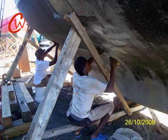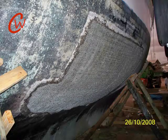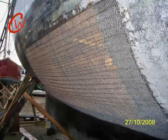The ties are done with a device that we manufacture ourselves — a potato bag closer with a small pair of vise grips welded to it. You use wire staples, hold the two ends of the staples together and pull, which spins the vise grips and creates a nice tie, then it is tucked into the metal fabric so it doesn't stick out.